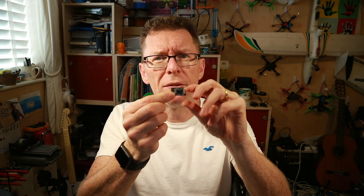Pretty impressive stuff. I really like things when they just work, but I like it more when something does more than I thought it would. When I heard about it I thought it sounds like something that people without OSDs might like to use for their setup. But really it's the app that's the star — having basically a fully-fledged version of Betaflight that you can connect to wirelessly on your quad and change anything without the hassle of a laptop, cable, or having to plug in. Even if you had an omnibus board with an OSD on board, you can still set up so much on that, including the OSD itself — moving things around on screen and accessing all the CLI commands.